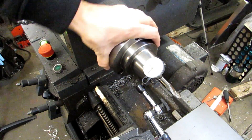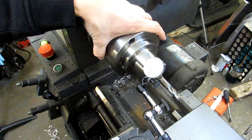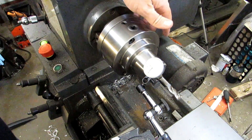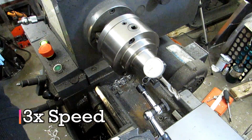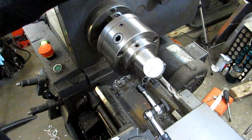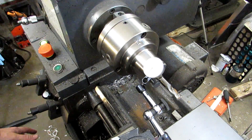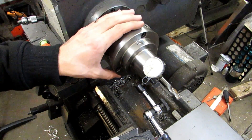Let's check our readings again. We've got about four tenths of difference between these two screws, so let's see if we can adjust that. It's touching less on this side now, so I need to tighten up this screw to drag it forward. Those two are reading the same, and those two are reading the same. So that looks pretty good. At this point my chuck should be dialed in pretty well and I should expect to get pretty good concentricity on all of my chuckings with the collet.